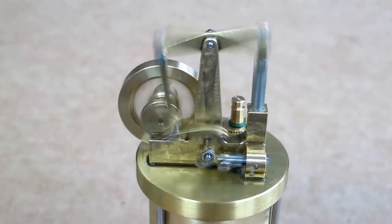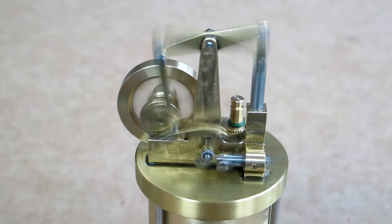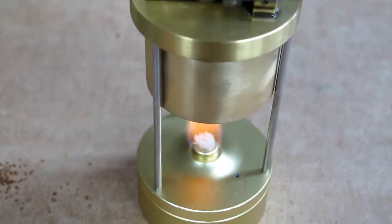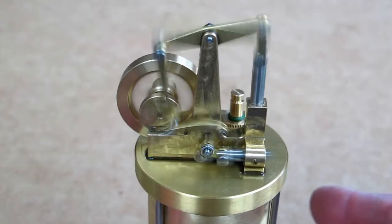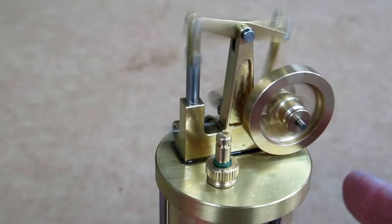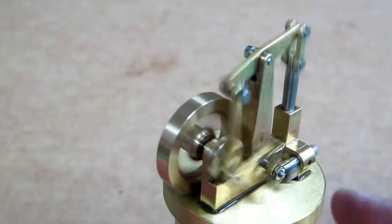This is a good speed for this. If this starts screaming and the pop-off valve is whistling, your fire is too big — you're running it too fast, slow it down. This is actually running a little bit faster than what I would care for, so I'll move that fire down just a little bit. I've reduced that fire and I haven't heard that pop-off valve going — that's a good thing. Operate this at a sensible speed and it will last a long time.